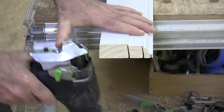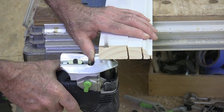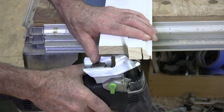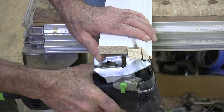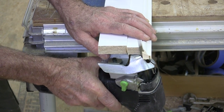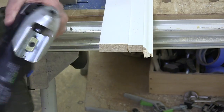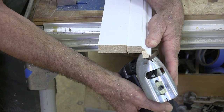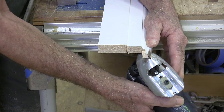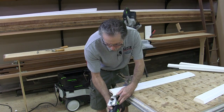Now I'll switch to the push position. Rock the tool back, and lift the blade up. Rock the tool, lift it up. Over and over again. We'll take the waste out of this OG a little different way this time. Just work the blade up and wiggle it as we go. We'll get most of the way up there, come back from the top. But we'll get rid of all the waste on the way down. Rock that blade and tip it sideways so you can undercut this. All right.